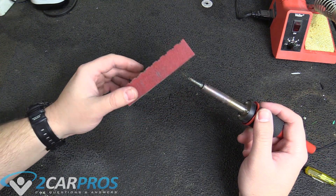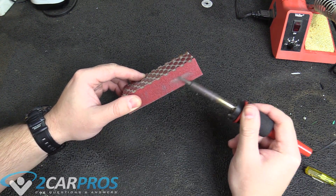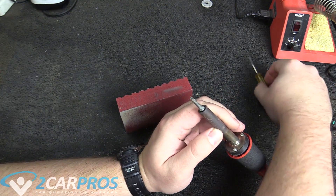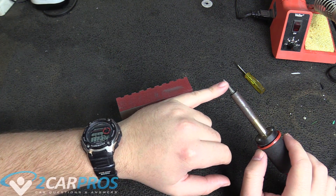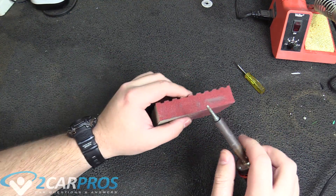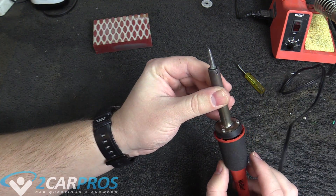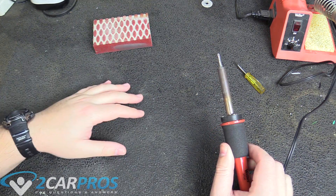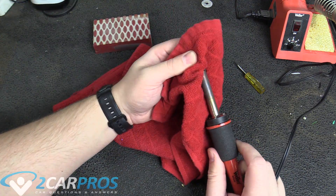The next thing we're going to do is sandpaper the end here, or you can use a sanding sponge. Any kind of sandpaper will really work fine — not too fine. You're not creating a finish you're going to paint on. You're just removing some of the old solder that's on there, some of the old tinning, so that proper heat transfers to our new solder. See how nice and clean the soldering iron tip is now? Make sure it's still nice and in place. Then we need to clean it off with a paper towel or a rag.